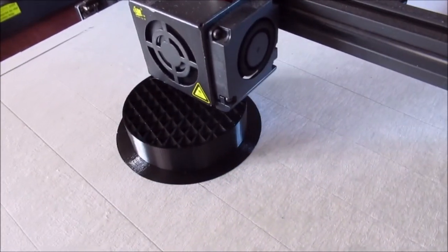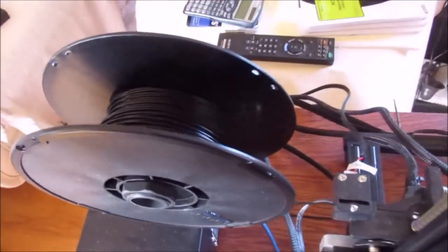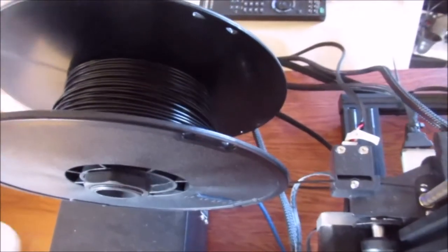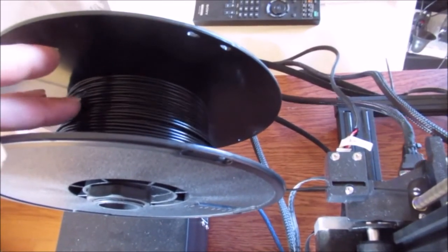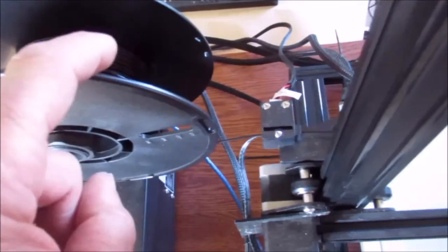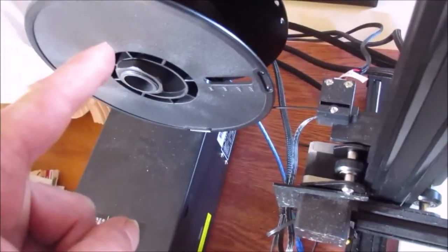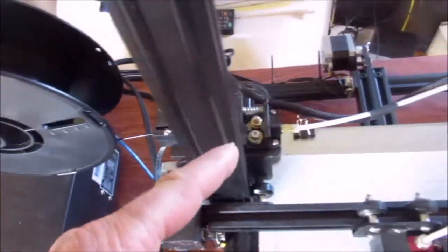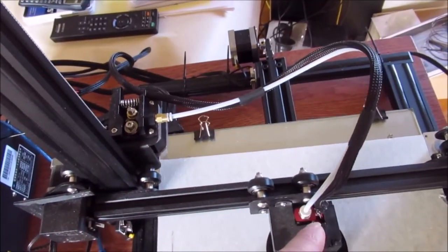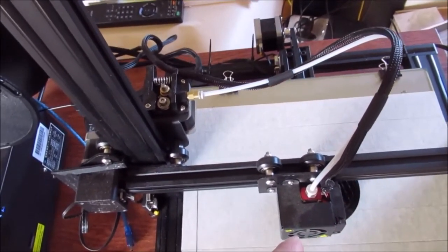And I noticed one thing. Once your spool gets down to the low level, if your filament binds or isn't loosened up a little bit, it binds, and this servo right here pulls that in, and then starts spinning in a void on the same piece of wire, and your printer doesn't know it. It keeps on printing, but there's nothing coming out.